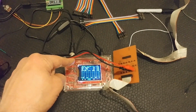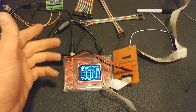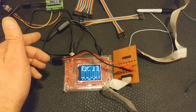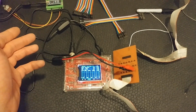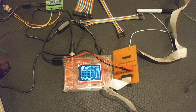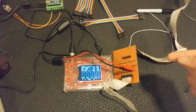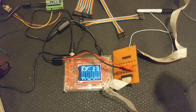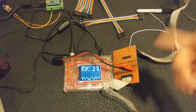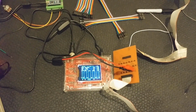This is not the control waveform. This is the feedback waveform from the little Hall effect sensor. And again, that checks out, because the fins on that metal disc will flash by the Hall effect sensor proportional to the speed, and they'll give you a frequency modulated waveform. So yeah, that all works. And I might use this later on, taking the reading off of this to be able to say how many RPM my lathe is turning, or what the surface feet per minute is on a belt sander. Right? You can read that out and make use of it, even though it's not the one that controls it. So on to the next pin, and we'll keep on looking.